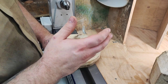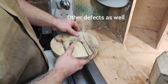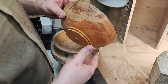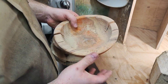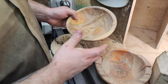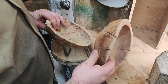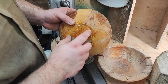The point is: check your wood for splits. These cracks can be quite dangerous as you saw. Now, if you have balls like this — this is plum — as you can see it has cracked severely. Some of you might be tempted to fill these and turn it, but I advise you: don't. It's not worth the risk. Here is another example, same wood. I have around 500 roughed-out balls, platters, and plates, and pretty much only plum likes to crack severely like this.